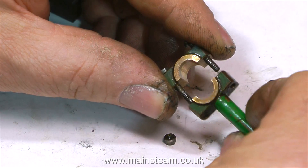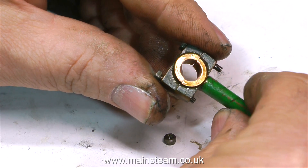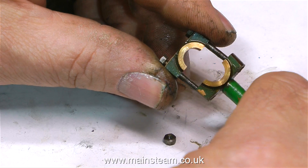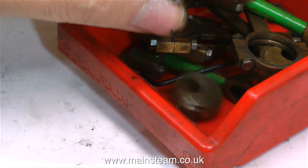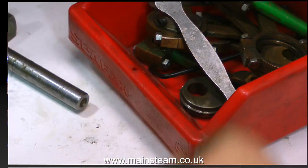Just to show what happens if you put it back together the wrong way around, it's obvious that it's wrong. For now, I'll reassemble it loosely so that I know which way around it goes. The last job is the removal of the two remaining eccentric sheaves. There goes the first one and here's the second one. You will notice that I also put the tools used to remove the parts from the crankshaft in the box.